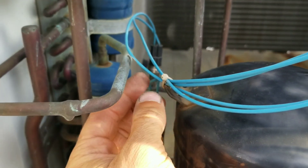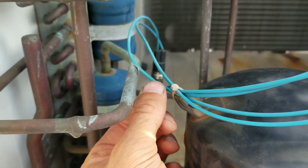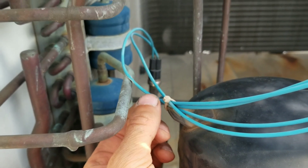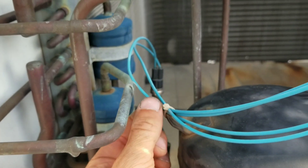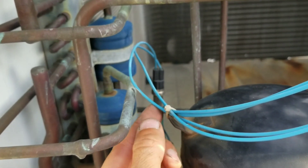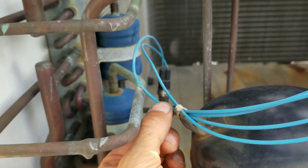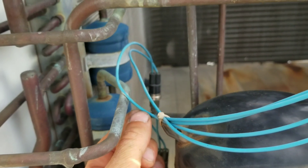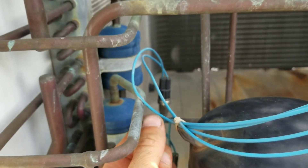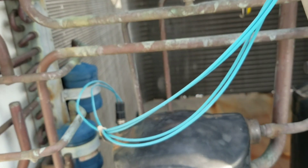With something like this, where it's held in a certain position, it was probably bouncing around from the vibration of the condensing fan motors and the indoor blower motor coming on, which would cause it to shift a little. The first time I tested, it was probably laying right on that pipe, and then during my second test some of the vibration knocked it loose — and that's why my popper didn't pop.